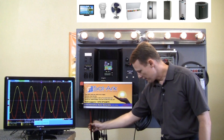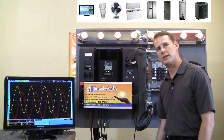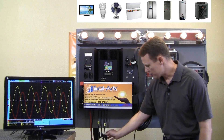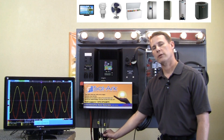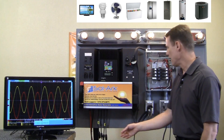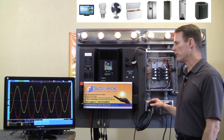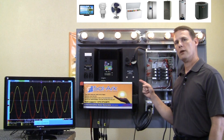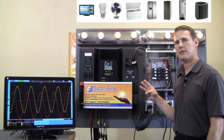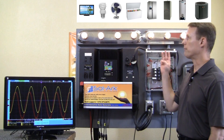So a few connections. The battery bank is a 48 volt battery bank, and we can scale from 4 to 16 batteries. The solar panels are able to scale from 3 to 15 solar panels based upon your power requirements. And we also plug the solar arc into the grid so that we're able to use solar power or batteries or grid as necessary to maintain the lifespan of the batteries as well as power your appliances.